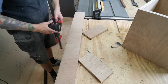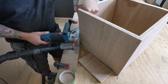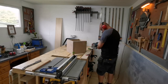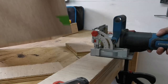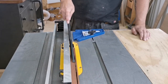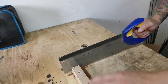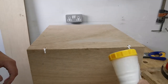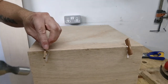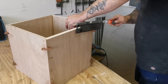As mitre joints aren't the strongest, I decided to add some splines to the mitres to make them stronger. Here you can see I'm setting up the jig and I'm going to use my biscuit jointer to cut the holes for the splines. Then I'll move over to the table saw where I've got a little bit of mahogany, and I'll set that up to the dimensions of the biscuits — about three and a half millimetres — and cut them as the splines. Using a combination of the table saw fence and a featherboard as a stop block, this enables me to cut the thin strips I need. I use a tenon saw to cut the splines to length, then putting plenty of glue in the mortises I hammer the splines into position and leave them to dry. Then I use a flush-cut saw to flush these off and sand them down smooth and level with the rest of the box.